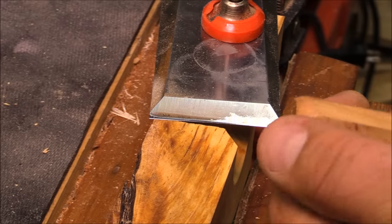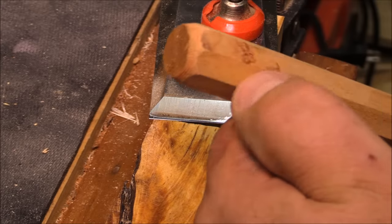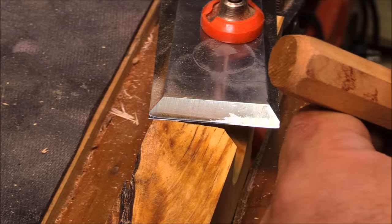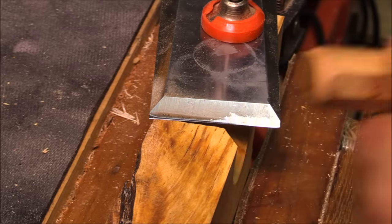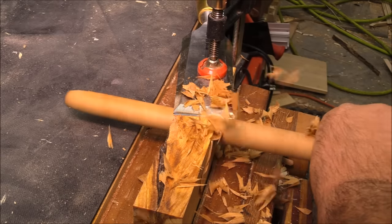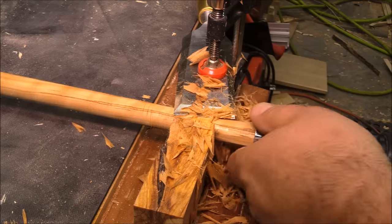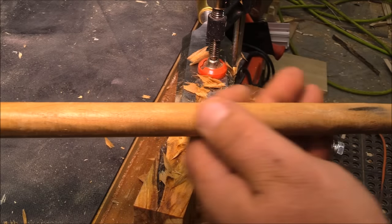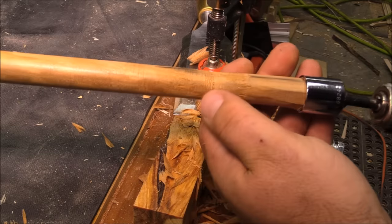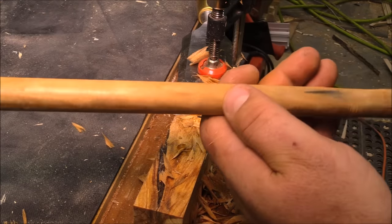When I start this, I've sanded a little bit of a point down. I want to start low, kind of work my way up into it, and you can see I've knocked all the edges off of this piece of cherry that I'm cutting. I've got this as close as I can get it to the final dimension. If you can keep a nice straight path through there, you can almost see the shine on that — you get a really nice clean cut this way. Towards the back side there I jumped a little bit, but if you can keep a nice steady push through it, you'll get a really nice looking dowel.